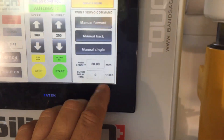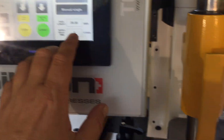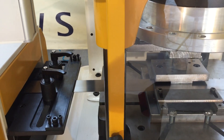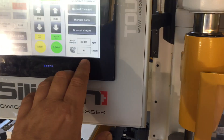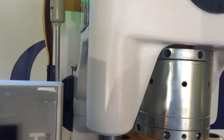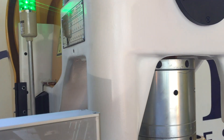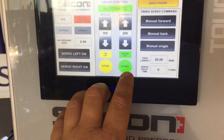The timing should remain the same, but it usually needs correction. If the strip is moving too soon or too late, you must adjust the delay — here on the timer, or on the back of the flywheel. The inner disc is used for adjustment of the servo delay.